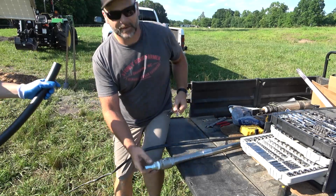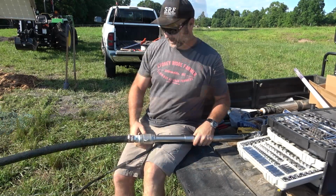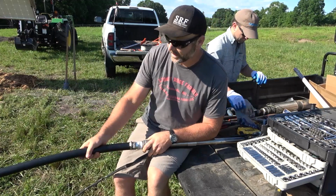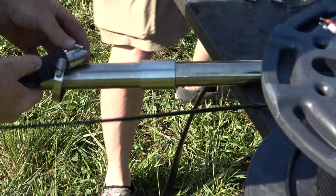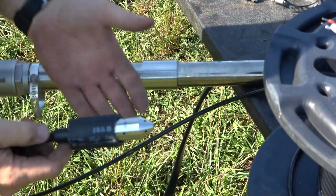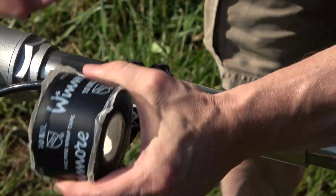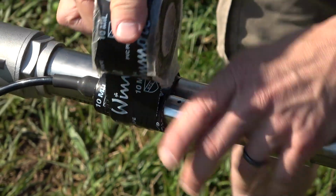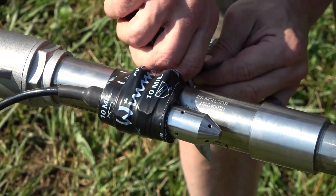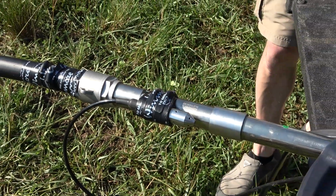So we've got our 200 feet of pipe measured out, and we're going to go ahead and install. This is 1.25" poly. So now we're going to run our power cable all the way out to the end of this 200 foot long. We already measured out 200 feet of poly. This is a sensor right here. This sensor goes down in, it'll be mounted right here to the shaft on the pump. This sensor will read how much water is above the pump at all times. And I can again hook to Bluetooth on the phone and come up here and check this. This will check the drawdown of the well. There are sensors in these little holes right here, and we want the torpedo to be facing downward toward the pump.